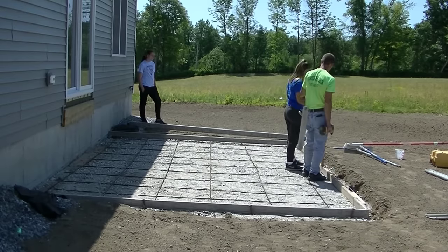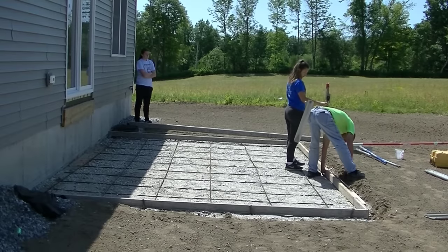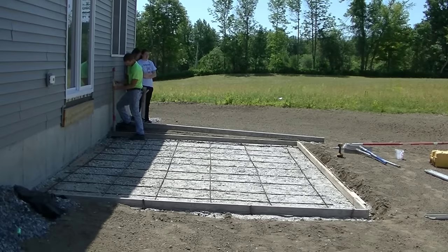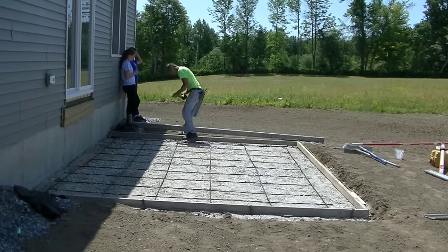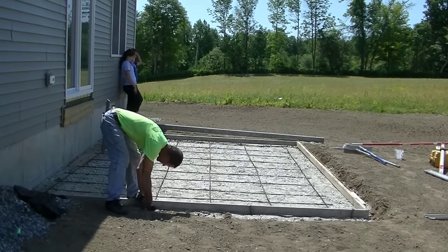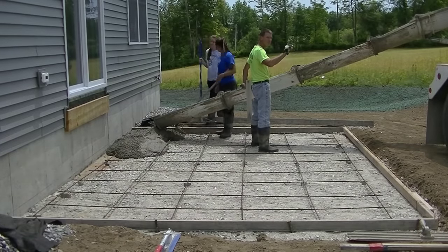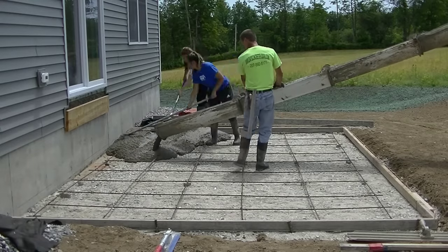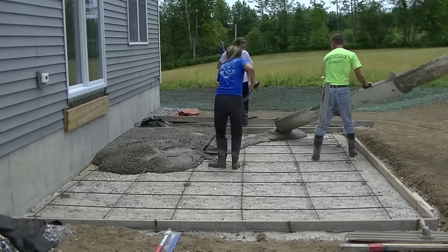We're pitching this, sloping it away from the house about an inch and a half, so when it rains the water will go away from the house. The roof line drips on it too so it's going to see a lot of water — we just want to make sure the water doesn't puddle. I'm real fussy about my grades and pitches; I want to make sure everything's perfect, so I usually double-check everything. Now we're getting the concrete poured. We're using 4000 psi concrete with a 3/8 stone, called a P-stone — it's a little smaller than a regular floor mix, and I like the 3/8 stone because it stamps a little bit easier and leaves a better impression.